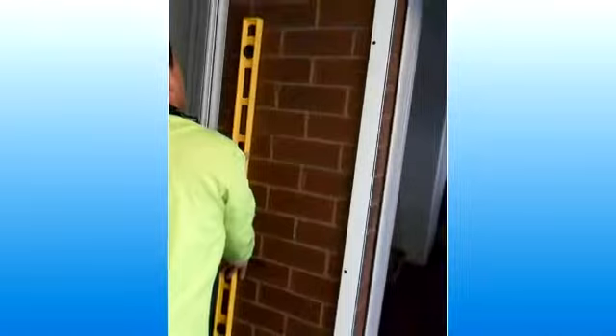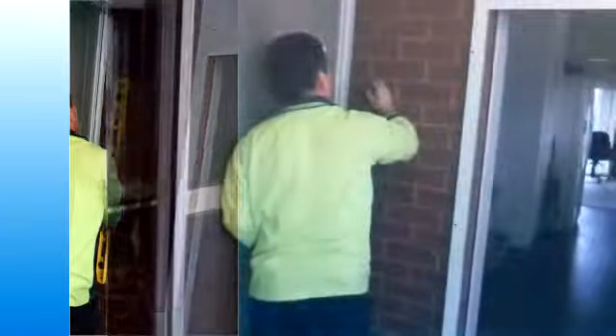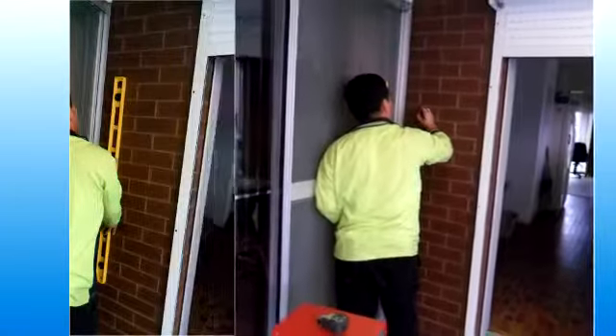When you have prepared the tools, you can start installing your shutters. Step 1: using a level, draw a vertical line for the screw holes for installing a guider. The guiders normally will be placed at the edge of your window. Label X on the appropriate wall side for your screw holes.